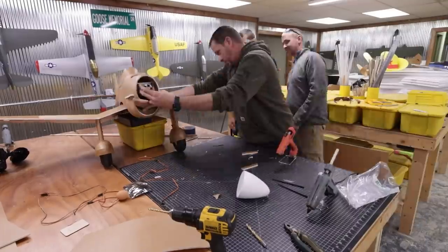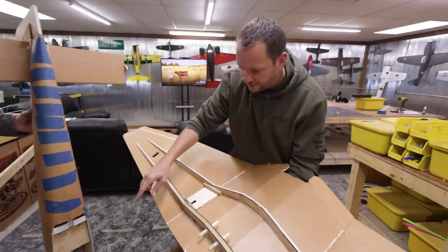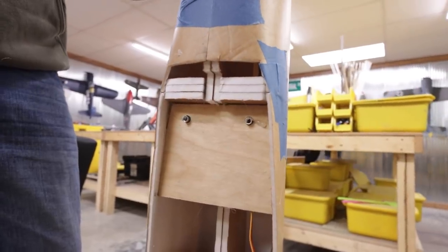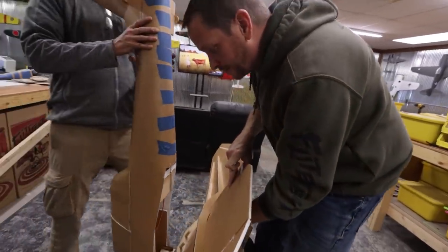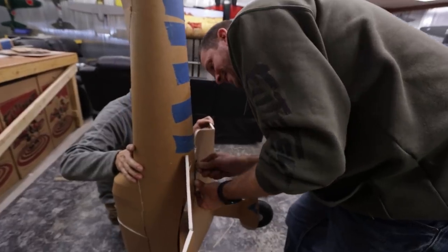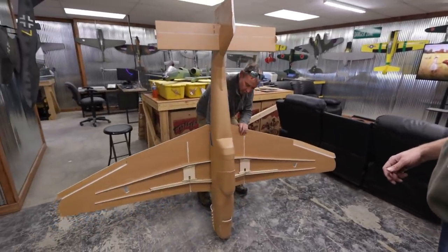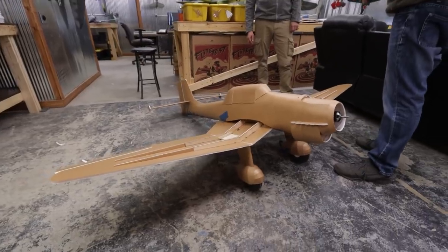I'm really excited about how incredibly fast this all went together and the shapes we were able to achieve with just simple foam and common molding techniques. I'm also excited about how strong this wing is without sacrificing extra weight. We've got our wing hold-down mechanism with two pins in the front, and we modified the firewall to become our wing hold-downs, with a plate and blind nuts on the back. Blind nuts are really cool because you fasten them in and they don't come out. Test fit successful — this holds together better than a lot of balsa wood planes.